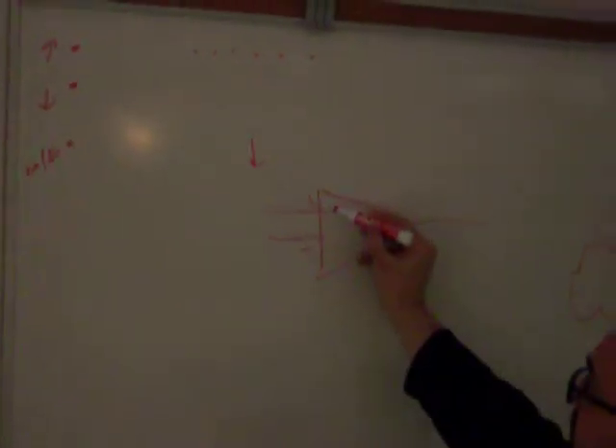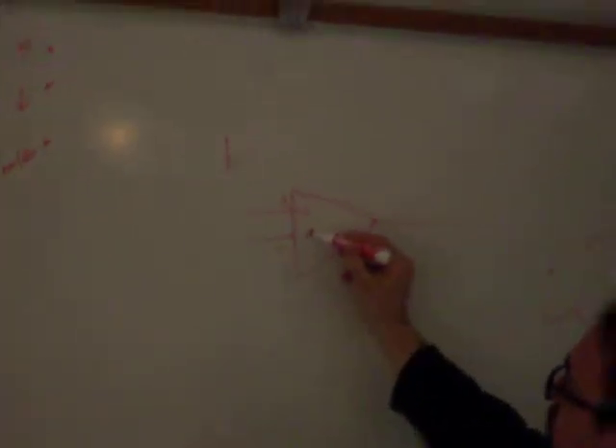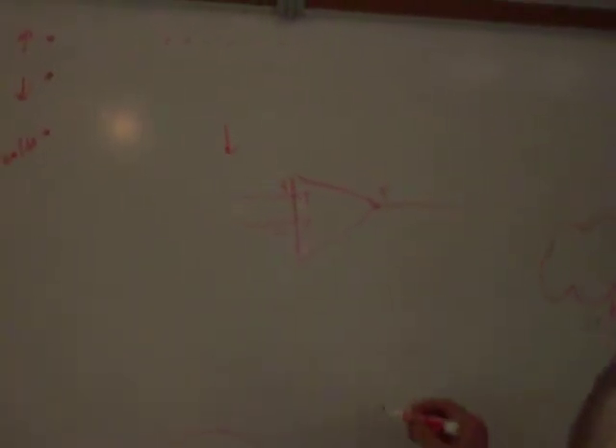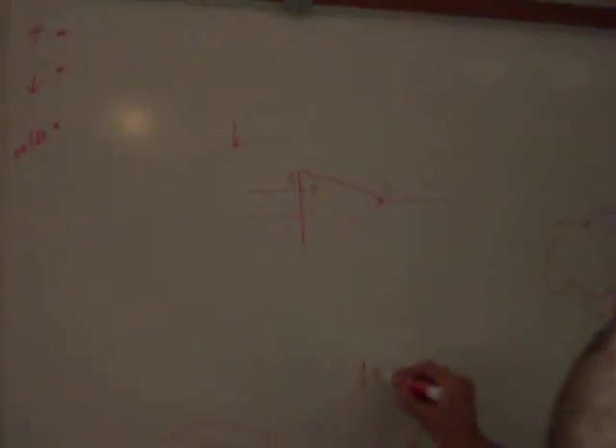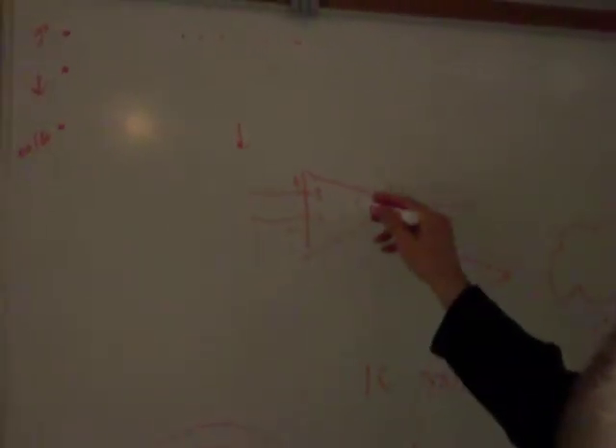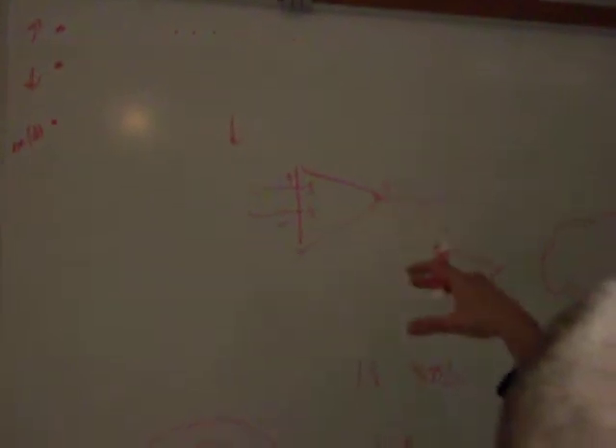The diagram will reference pins like 2, 3, 5, or something like that. And then somewhere in the parts list, you'll see something that says IC386 or whatever. You might even see a couple of these — there are some chips that have more than one unit broken out, but they're actually the same chip, just different pins. So if you ever see that symbol, that's what that's about.